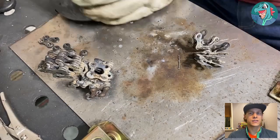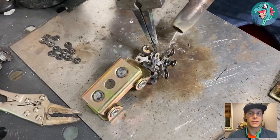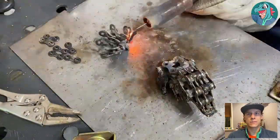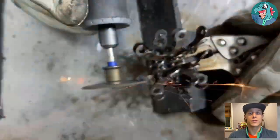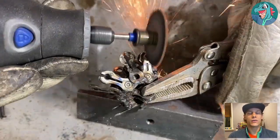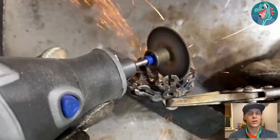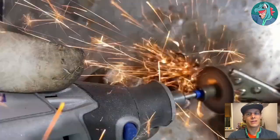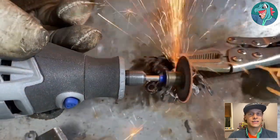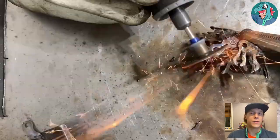I got the main part of the fire set up on Cinder Quill just to make sure it would fit, and now I'm going back and adding more single pieces wherever I see an empty gap. Once I'm happy with it, I go back with the Dremel and a cutting bit to cut each of the links in half — only about halfway to three-quarters down so I don't disturb the welds at the bottom, since they're very thin. A couple still broke off and needed re-welding. I also try to use chain links that already had slits in them, as that makes cutting much easier.